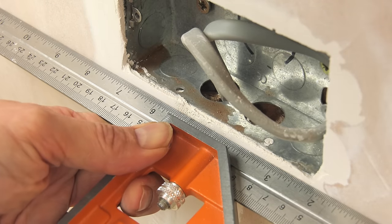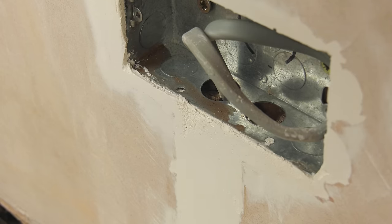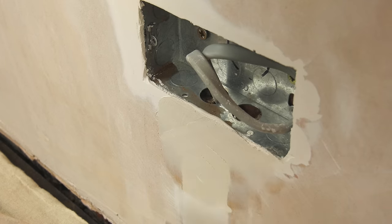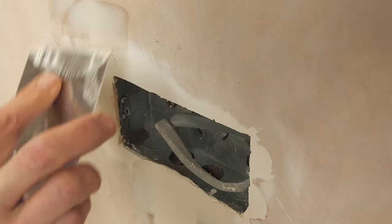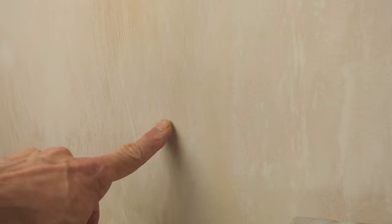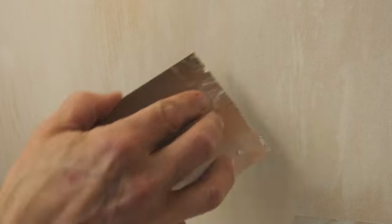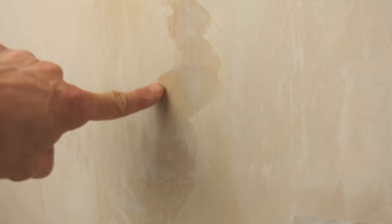We've just got the odd area where I just need a little bit more filler, even with my efforts to leave it proud of the surface. Using one of my widest continental filler knives, I have the relatively straightforward job of simply smoothing some additional filler onto these low points. The brilliant thing about these filler knives — and this is particularly good when you're filling cracks in the wall — is you just take a little bit of filler onto the knife, lightly draw it across the surface, and the crack's gone. It will require almost no sanding before repainting, and that is why this is such a good snagging filler.